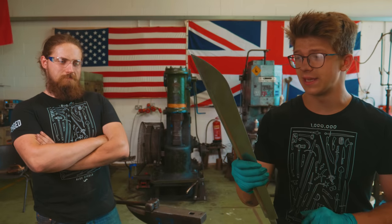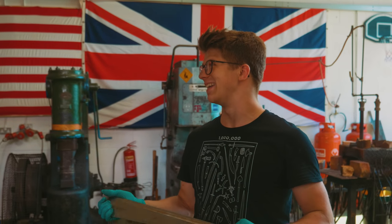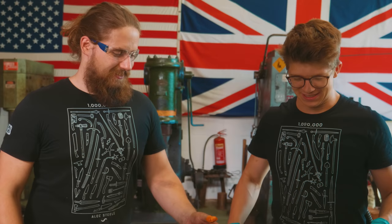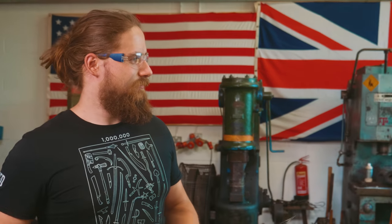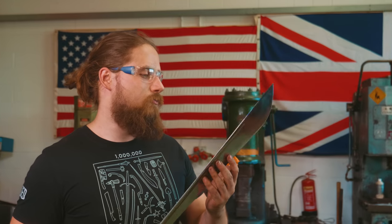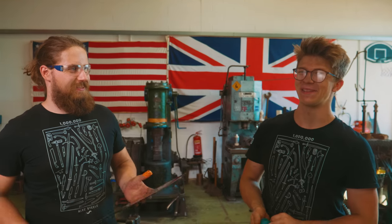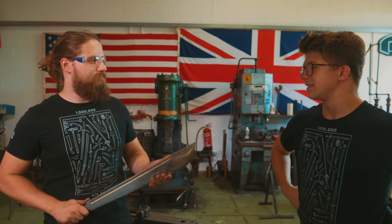The next step on this is, I'm sorry to say, dear pal Alex, good old Alex, it's your turn to do some work to it. Yeah, so it's at an A45 trizact. You've given me a really good finish to start on. Made my life a whole lot easier. Well, I don't know about that. That's what he thinks. I left a couple of 36 grit scratches in there just for you. It is time for the hand sanding.